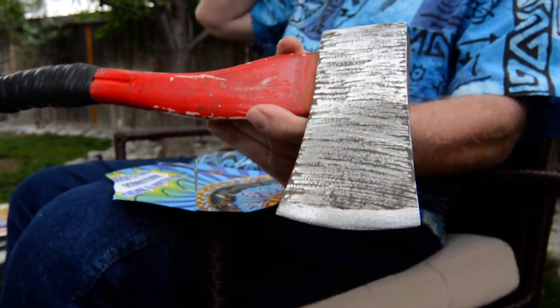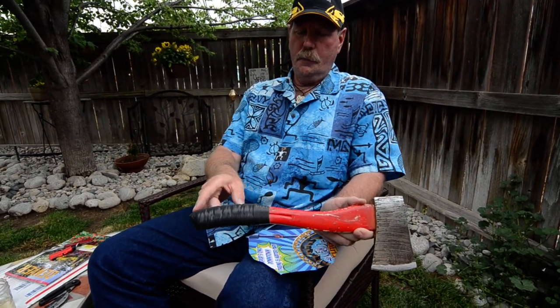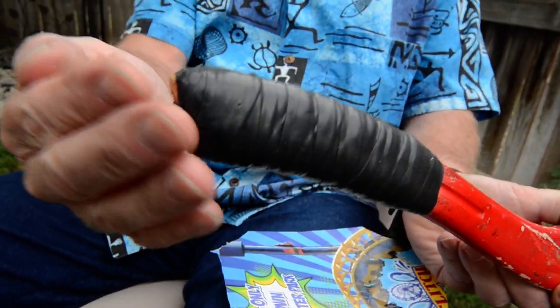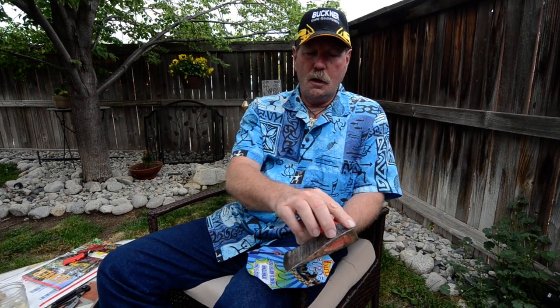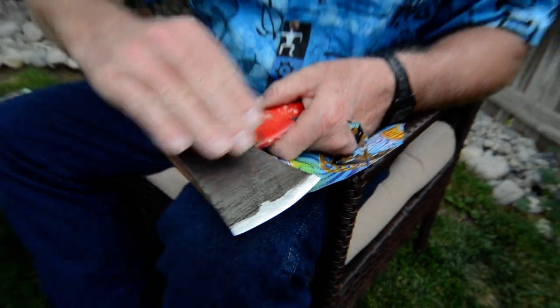This was maybe five, six weeks ago — maybe two months ago — something like that. It was bought for a dollar, actually a giveaway at a yard sale. The handle was all screwed up, so I took some silicone tape and went around the handle like that, made it a little bit rougher. It's a little bit softer and easier to hang on to than the fiberglass handle. The handle was kind of broken so I wrapped around the end. The head was all rusted — somebody had beat on it pretty seriously. The edges were mushroomed out a little bit, so I took my little Work Sharp and sanded those. It was real rusty, so I took the round rubber pulley on the end and went back and forth on it, turned it over and did the same thing, cleaned it up. Now it's actually kind of a good-looking little hatchet — not rough on the edges anymore.